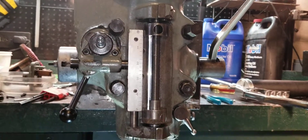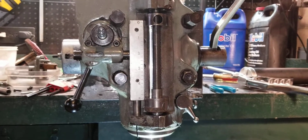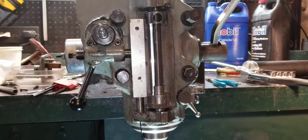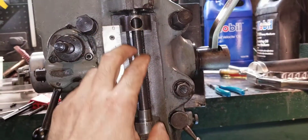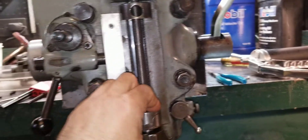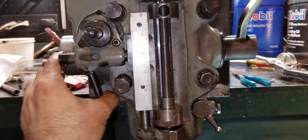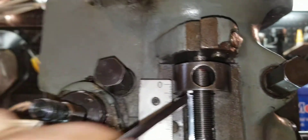Here's a little adjustment you won't see many places. I'm going over this to make sure all the feed mechanisms work, and I just realized the upper feed disengagement wouldn't work. There's a lower feed — when this comes down and hits this, it pushes down on this entire rod, actuates this, which pushes the pin up and allows this to drop out. Now it's disengaged, so it would stop feeding. There's also one for going upwards — that's this little pin sticking down here.